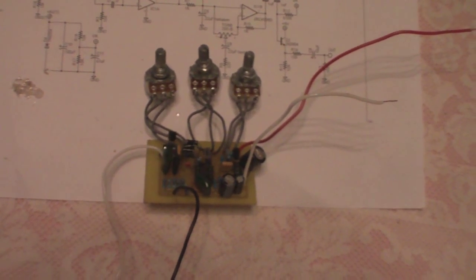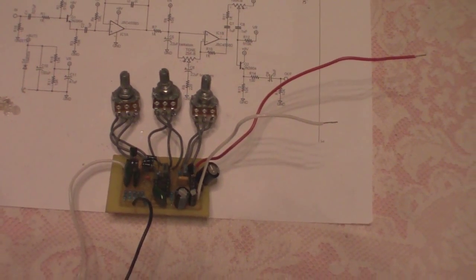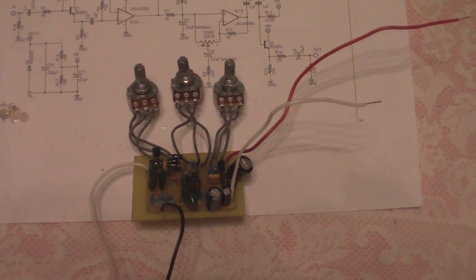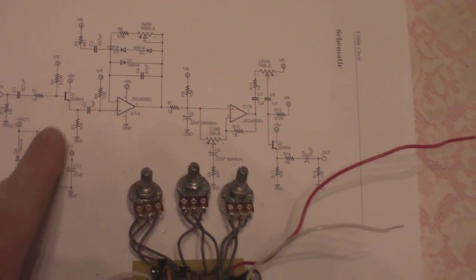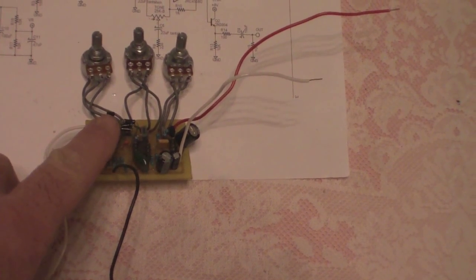So what the result was, now I don't know for sure, because the other thing that was going on was that my battery was a little low. So I do have to try it with a full 9 volts, because these pedals, as I remember from years ago, really do behave differently when the low voltage kicks in. Anyway, what it seems like is the difference between the 1N914s running the suggested 2N3904, that's what's in there right now for transistors, is like a nice, soft, and relatively subtle overdrive.